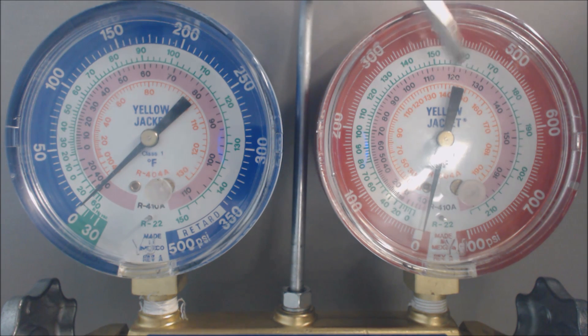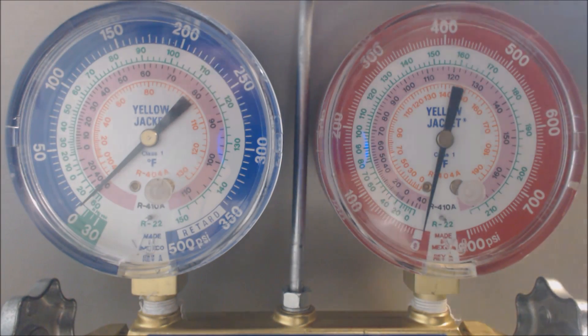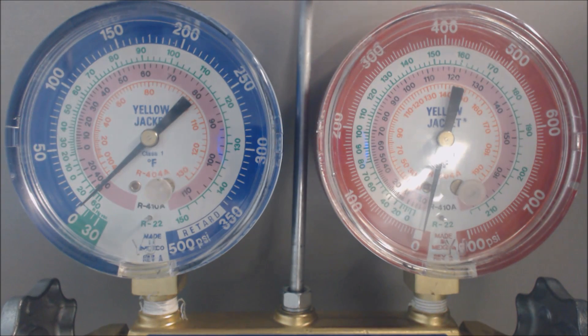You can follow the dial into the 410A vapor range. Even when checking 410A subcooling — which is common since many comfort cooling systems have TXVs — you still want to get the vapor pressure above freezing. If after two minutes you're stuck at a vapor pressure of 75 psig, you're looking at roughly a 17-degree evaporator coil. That coil is going to freeze, get frost on it, and you'll no longer be able to absorb heat from the house — even if you raise the pressure, because the frost is still blocking absorption.